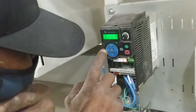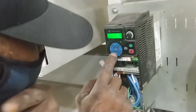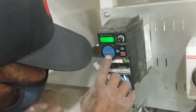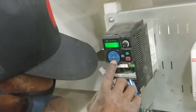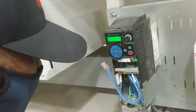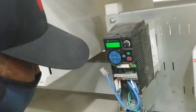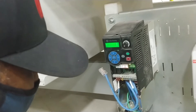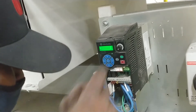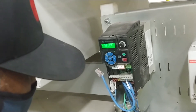Escape again. Now up to 47. Hit enter. You're on 15, so go down to 1. Enter. You see drive pot is your speed source. We should make sure the speed pot was all the way down — but it is all the way down already, so we didn't have to do that. Because you don't want the thing to take off.